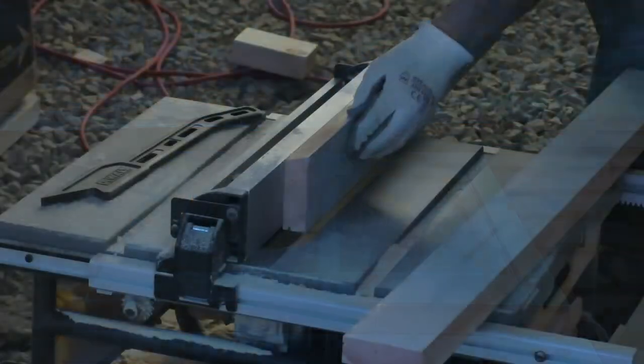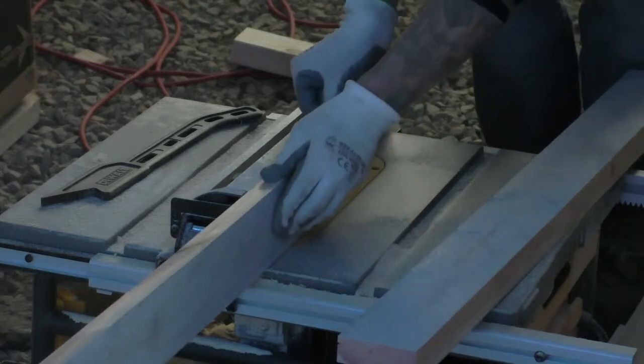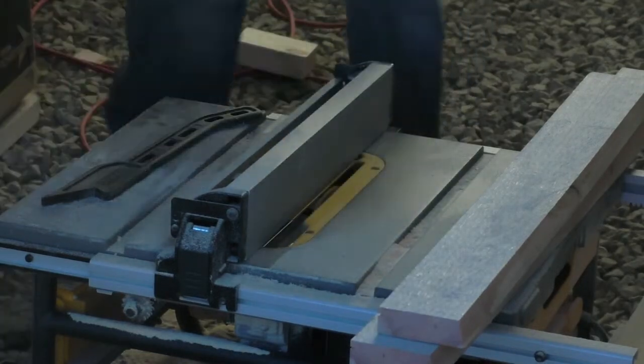Since this groove sits in front of the window, the drop should fall in front of the window rather than water hitting the window itself. Of course, if there's any amount of wind, water will hit the window. I actually did this for the bottom pieces of trim as well, but it made no difference because of how close to flush the trim ended up being with the siding.